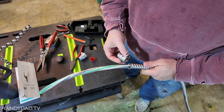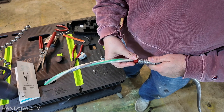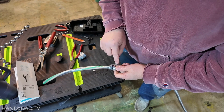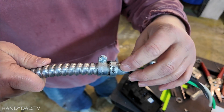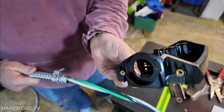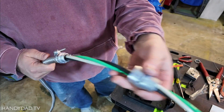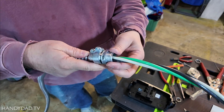Before putting the flex end on, you definitely want to put on one of these bushings — they fit over the conduit end and will prevent the wire from rubbing against the metal. I have it good and tight, and that plastic bushing is in there to keep it from fraying the wires. The only problem is that the hole in the end of the mounting plate is three-quarter inch and this connector is half inch, so I'm going to use a bigger three-quarter inch flex connector and clamp this around that one. It's going to protect the wire — that's the whole point.